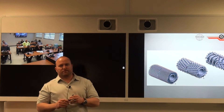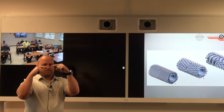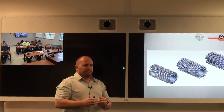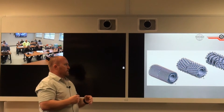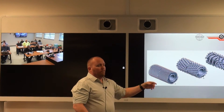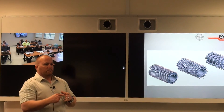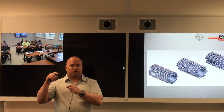Going back to what we talked about earlier: if we add more teeth, what's it going to do? On the far right, that's your standard 5/8 spacing drum. Every manufacturer's standard spacing is 5/8 inch — that means 5/8 inch between tip of tooth to tip of tooth. Then we start stepping up to what we call a fine texture drum, where you can take it down to say 8 millimeter or even a micro at 6 millimeter. Say 170 teeth, say 400 teeth, say about 1,000 teeth — you have a single hit fine texture drum and also double hit micro drums. With a double hit drum, you have two teeth in that same line spacing, 180 degrees apart.